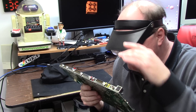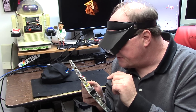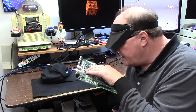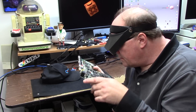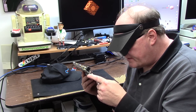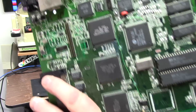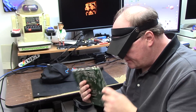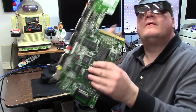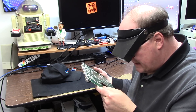I haven't even looked at the bottom side yet. I'm going to have to take the keyboard connector off to get to what was left of this positive potential trace. The two audio decoupling capacitors — one looks like it's starting to lift on the ground plane. No problem. Composite circuit through hole and cans still look okay. CXA 1145 video encoder looks okay. C821 near the PCMCIA is kind of borked out. The Lisa chip looks okay — it's a CBN Lisa. As far as your mouse movement goes, we'll flip her over to the bottom side.